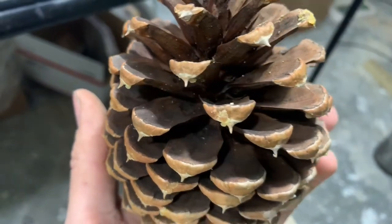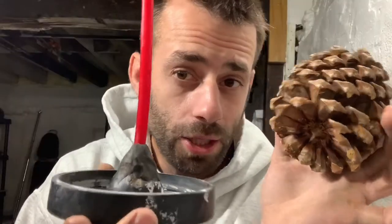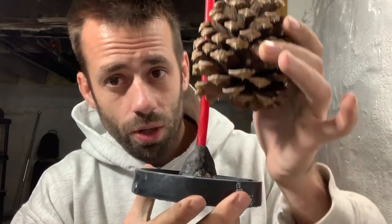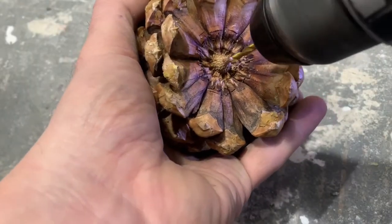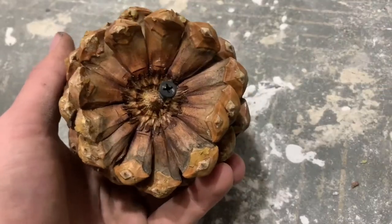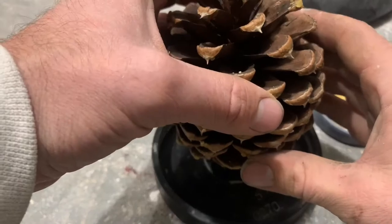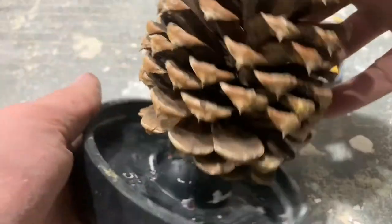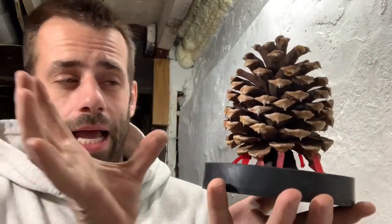You can see the pine cone has a lot of deep crevasses, so I'm going to want to make sure to put that in my vacuum chamber to get all the air out. However, when I vacuum seal this I'm kind of worried it's going to float up in the investment — I don't really trust the base. I put a sheetrock screw in the bottom just so the wax has something to grab onto, and then as it burns out the screw will fall away. I got the pine cone on the sprue tree and put a big mass of wax on there, because I think that'll help the ash fall out — the bigger the hole is.